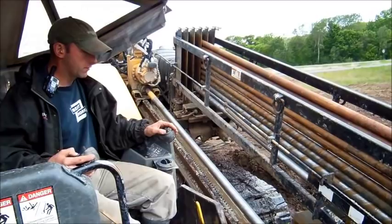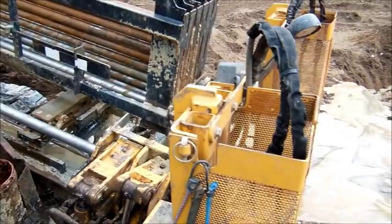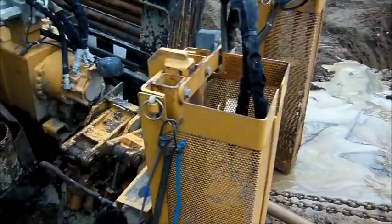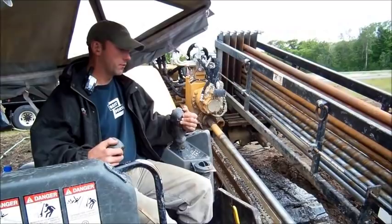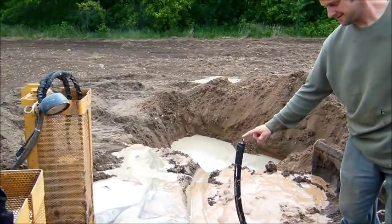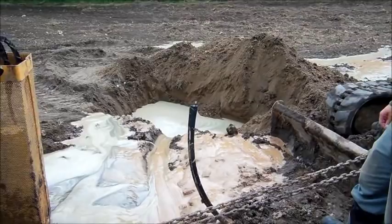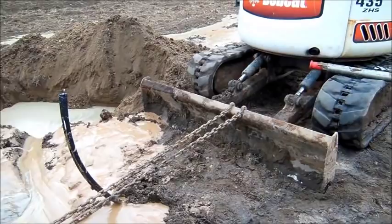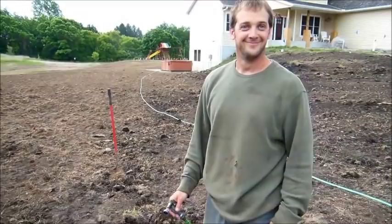As you can see, this is basically a backward motion of the drilling, and as it keeps bringing them back it's pulling the geopipe back with it. Eventually it'll end up with the pipes sticking out of the ground. How many of these are put into the ground makes a big difference depending on the type of geothermal loop field. Soil conditions also make a big difference in how deep they can get. So every job is different, designed by a geothermal professional like ourselves working in conjunction with good people like Tony from Best Bore.